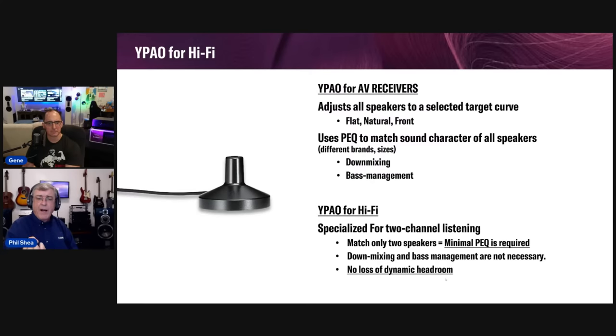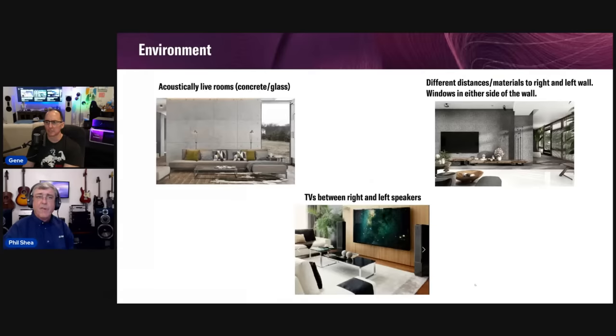By boosting something at a certain frequency, 100 hertz or 1K, you're boosting the frequency at 1K. You're also pulling up the noise at 1K. So if you boost something 4 dB or 6 dB or 3, whatever it is, to try to match the other channel, you're also raising the noise floor in that frequency band up that much. And that goes against our dynamic credo at the top, for true sound. We want to get that dynamic range, but we got to stay above that, not screw up the noise floor. You guys have all seen this, and you put a stereo system just about anywhere. Most places it's not good.